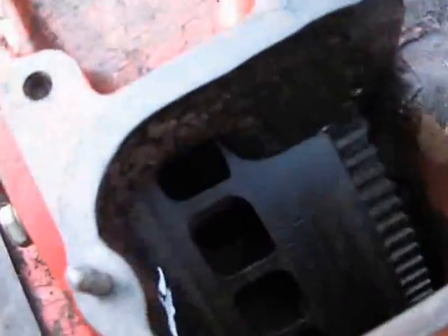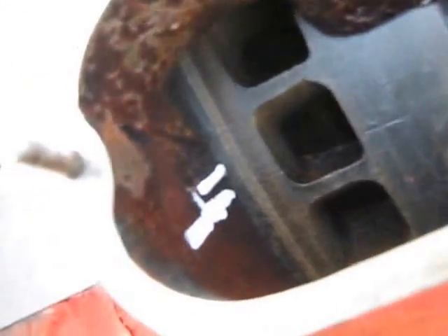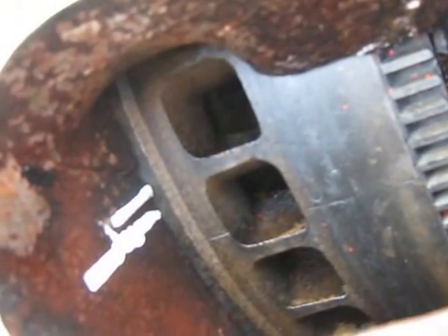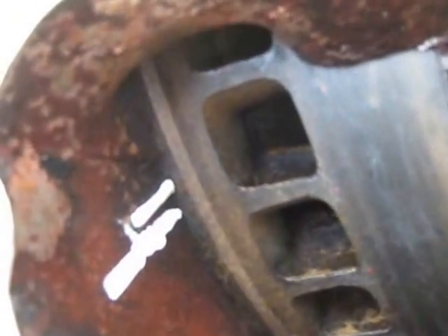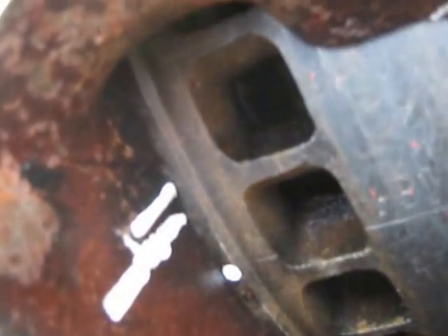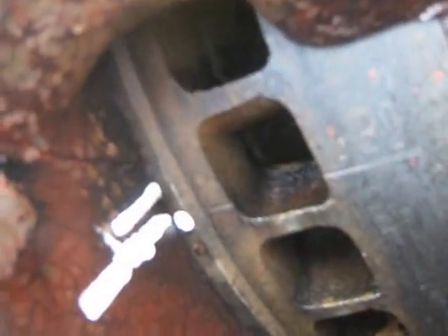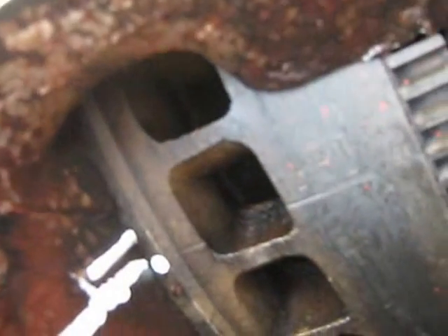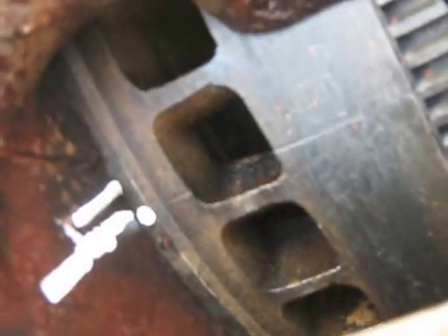I have found the timing marks as well. The timing marks are on the flywheel here and the casing — there are two timing marks. You can see the mark there: that's top dead centre. And the other one coming round is the timing mark for the spill — the injector pump. If you are putting a new injector pump in, you can time it with that.